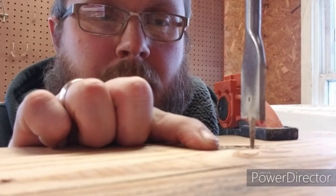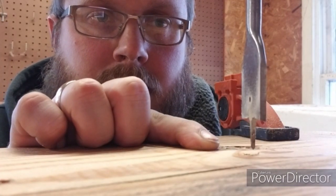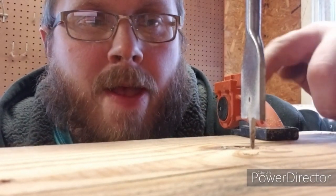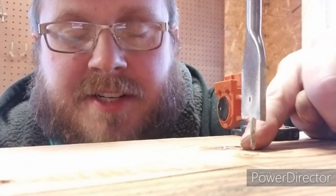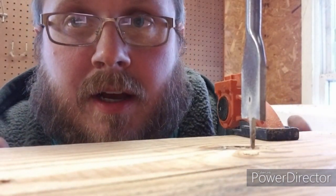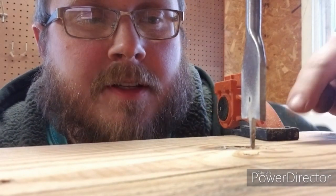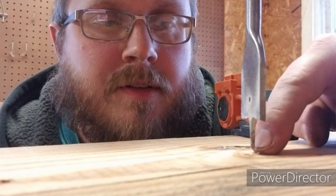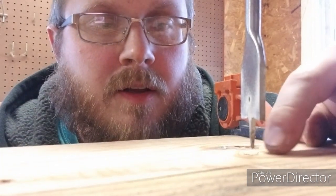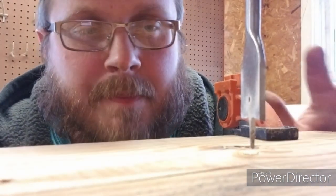I only drilled about 3/4 of the way through this piece with the spade bit because the nature of this bit tends to tear out the underside of your cut. So I just drilled enough to where the point of the spade bit poked through the bottom. Then I flipped the workpiece over